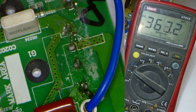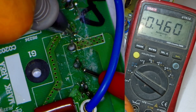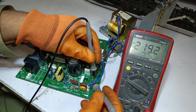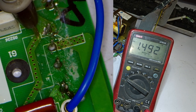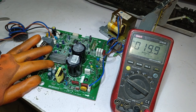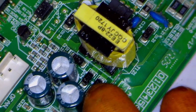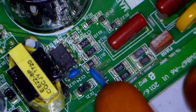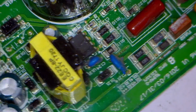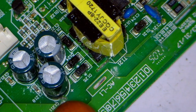Now I supply electricity to the system again, and the circuit board has been powered up. First, let's check how much AC voltage is coming into the circuit. Placing the probes on the AC pins of the rectifier, we are getting 220 AC volts. Setting the multimeter to DC voltage, we place the probes on the DC pins and the circuit is currently showing 284 DC volts, meaning DC voltages are being generated in the circuit. However, the circuit is still not turning on. It often happens in situations like this that the switching IC may be faulty. A very easy method to check this is by measuring the voltages on the three capacitors to get a good idea of the current state of the SMPS.